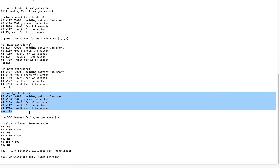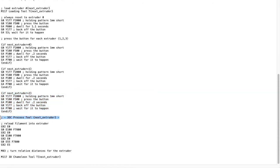And once we've made it there, we then go to this line here, which is actually just a comment, but it's very critical to the processing of this system. This line should never be modified or removed. The idea here is that we are telling the post processor that we put in the slicer earlier, that's that ReverseDrive Python script, which extruder we're moving to, and it knows based off of that which drives to run forward and which drives to run backwards.